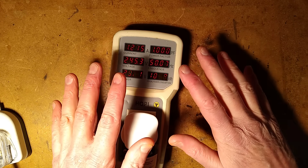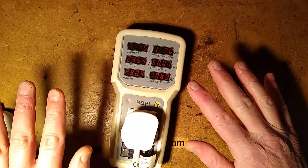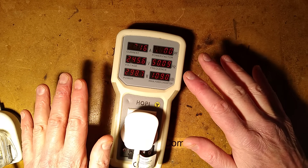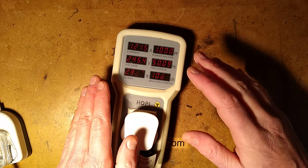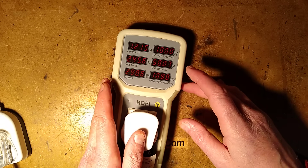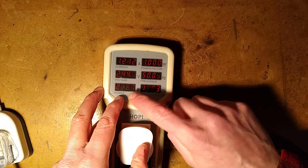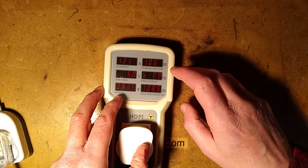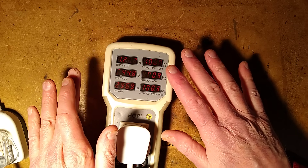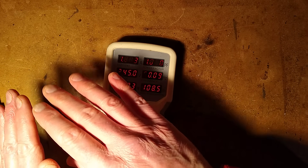It gives a very golden light — not actually a massive quantity of light, as it's optimized for infrared. But boy does it put out infrared: it is so hot instantly as soon as you turn it on. I've got a clamp holding it up at the moment, and it's drawing 300 watts pretty much on the button, which is very good — unity power factor as you'd expect, 1.2 amps. In wintertime that heat would be fantastic.